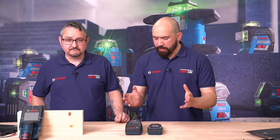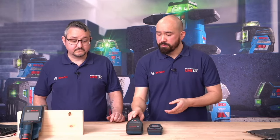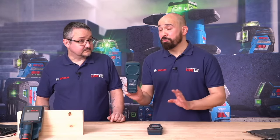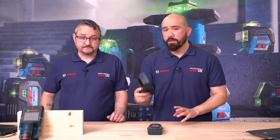And I think as I said, we've covered most of the information out there. What we don't have on site today is a concrete demo. But again, both machines work in concrete. The D-Tect 120 is excellent, especially if you're trying to find rebar, either to miss it, because you don't want to be drilling through the rebar, or if you're trying to find exactly where it is. Setting it to the concrete mode, the third mode there, will allow you to find things like metal embedded rebar and stuff like that. So if there are no questions, what time are we running, okay on time?